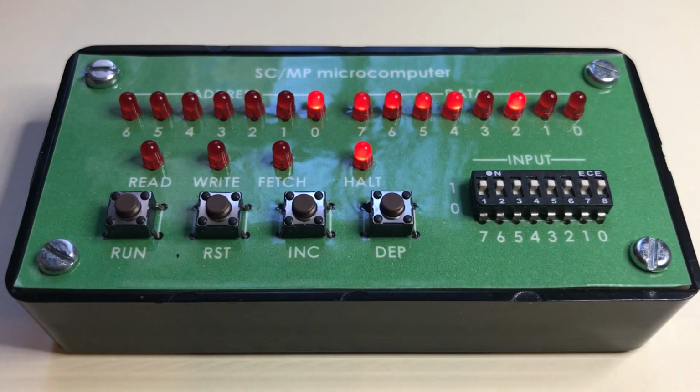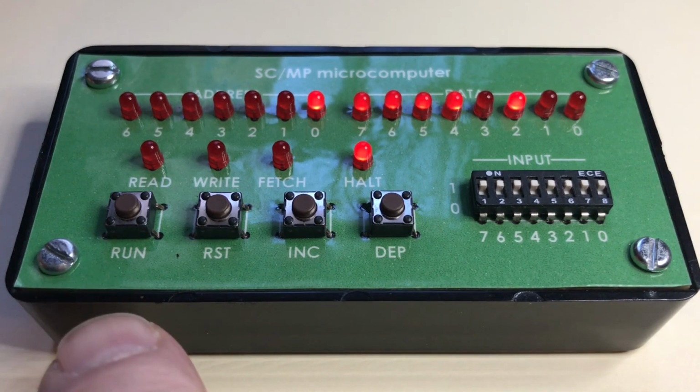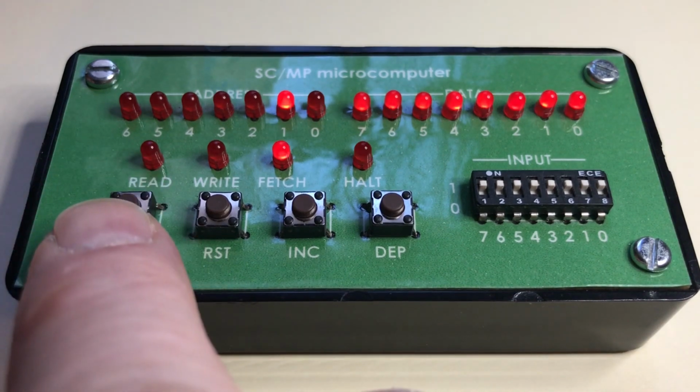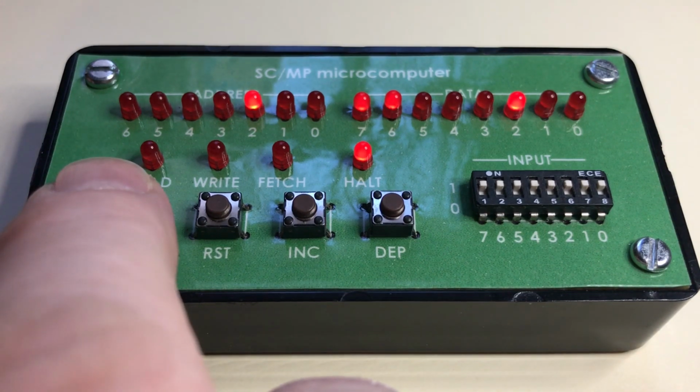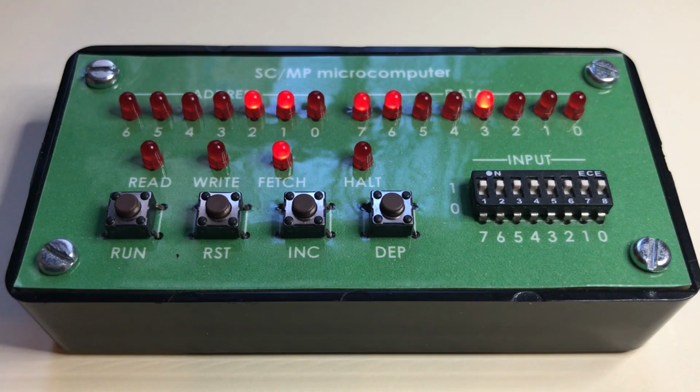So if we increment, which actually increments the processor to address 1, there's an item in there, so we can run it, and that fetches it and does it, increments to address 2, and then runs to the halt instruction again, which is at address 3. So if I increment past address 3, so we are now at address 4, there's actually a program here, which when I press run, will start to count up in binary. It's on the address bus, moving back and forth, carrying out the instructions. Isn't that cute? 3 little 1.5 volt batteries inside.